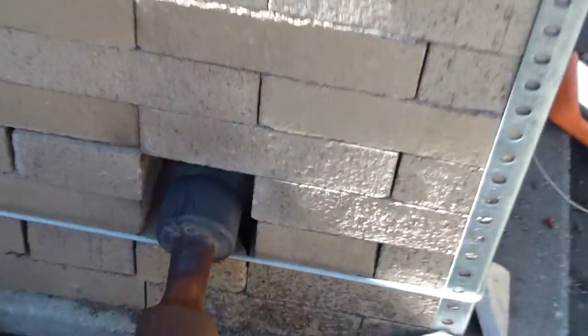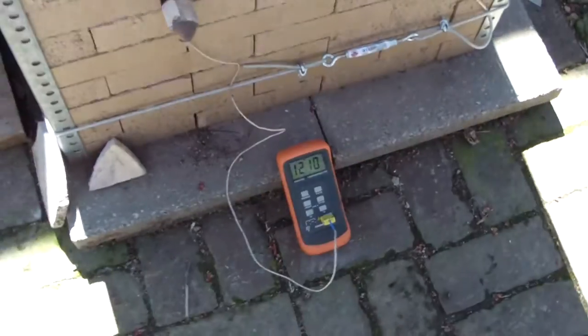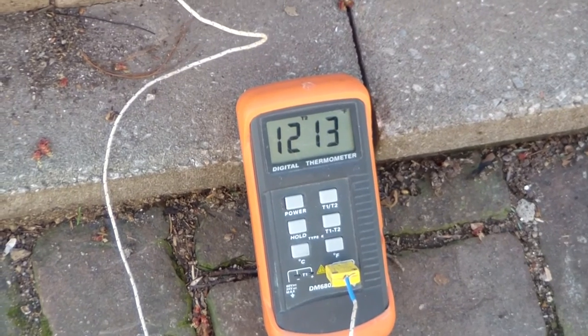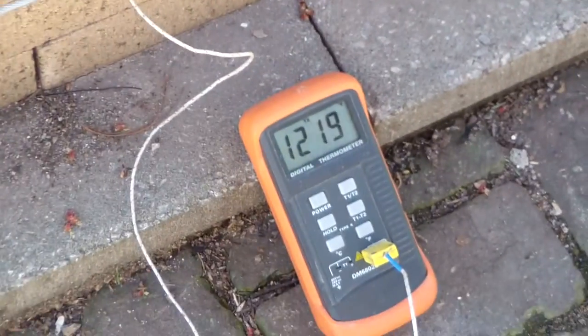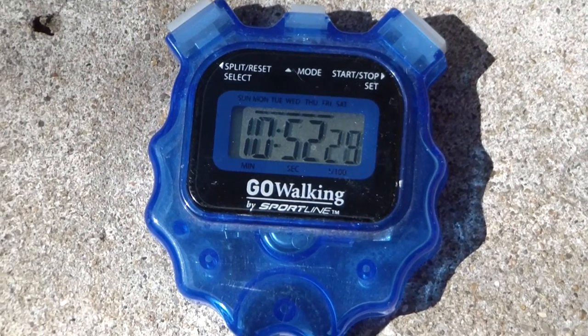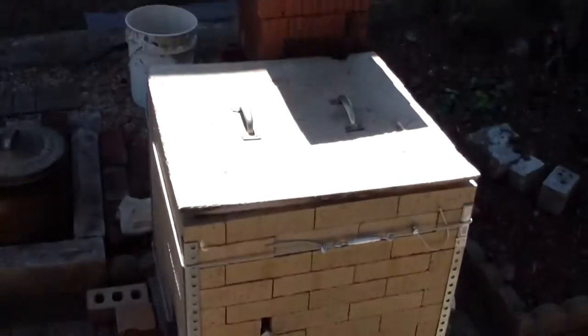If you look at the ceramic temperature, the digital pyrometer says 1212 degrees. It's going up just about perfectly — a little fast actually, since it's at 1219 degrees and it's only been firing for 11 minutes. It should be right about 100 degrees a minute, so that's perfect. It'll start slowing down after a while — a good firing is about 30 minutes.